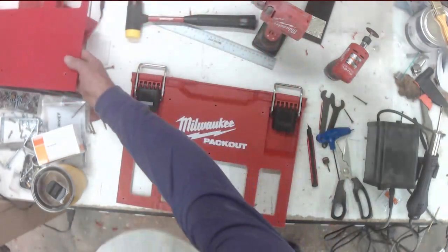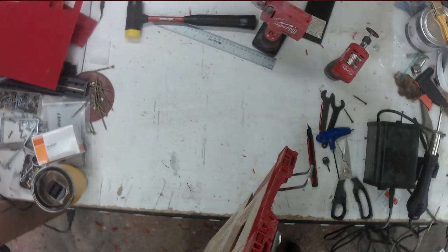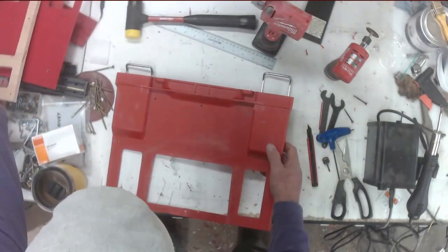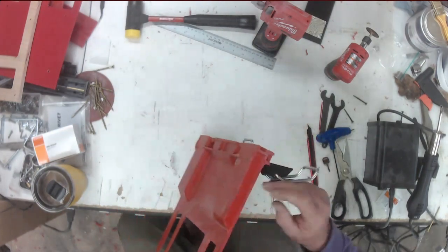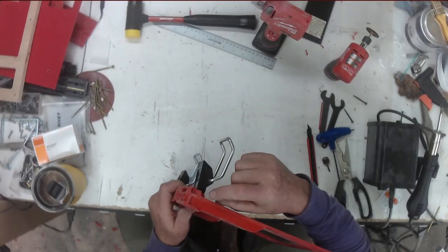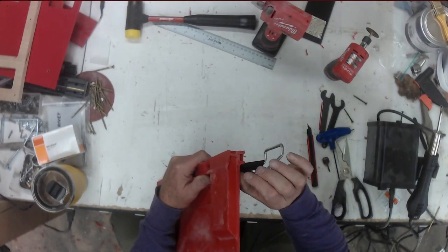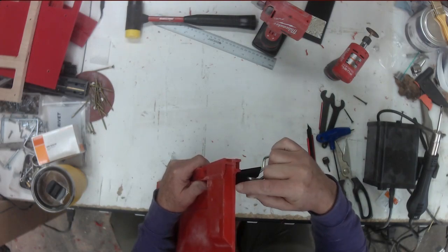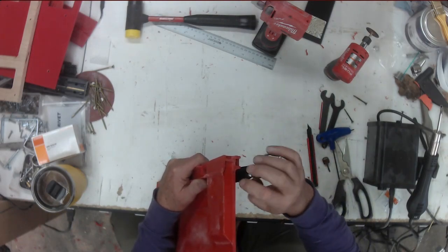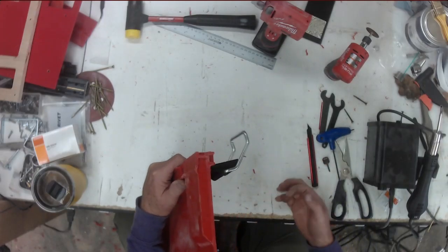Okay, let's weld some plastic. Like I said, I can do a little bit more cleanup in here. There's still a little bit of a ridge, and I'm trying to get that piece to be as wide as I possibly can. So I'm actually going to take this plastic back a little bit, and that way my V groove is just right there in the inside 90 degrees.